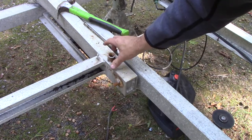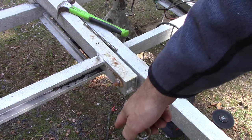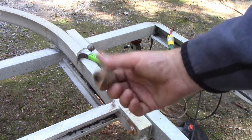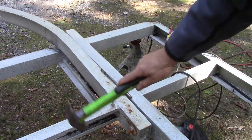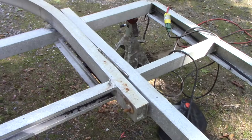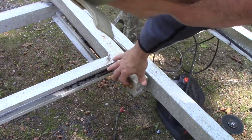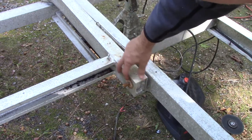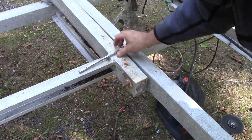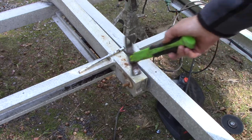I keep cutting the spring apart and it's all corroded. This bolt is still solid and seized in there, so I've got to get that out - it's the last piece of the puzzle on this side. There are some pretty big pits but I think I can address that. Banging on it isn't doing anything - I'll get the air hammer or something to drive it out one way or another, because I need to replace that bolt.